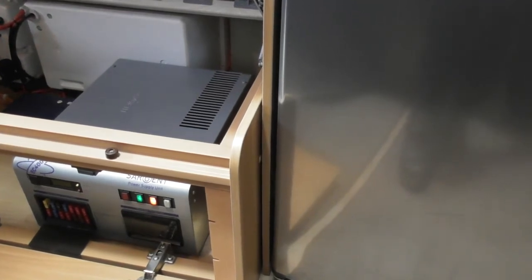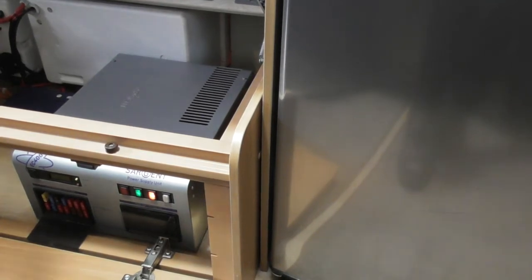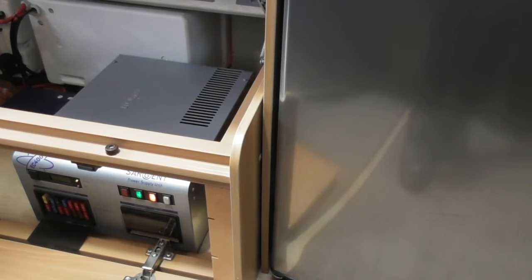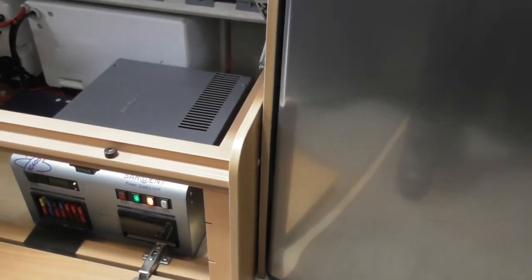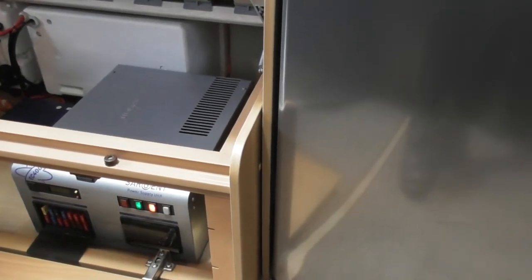Okay. So all you need to do is get yourself into a habit of turning that off when you're packing down, and then just remember, only turn that on once you've connected your water, you've dropped your valve, and you've pulled the water through your tap. We need to be careful with that. That is the one and only thing in here. Everything else, pretty much foolproof, perfectly fine. It's just that one and only switch.